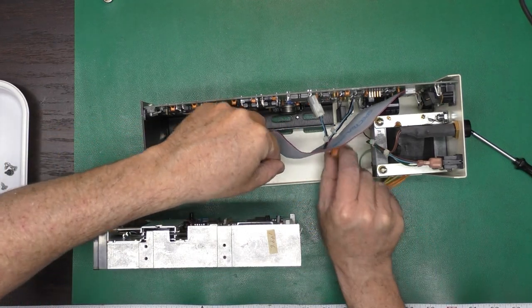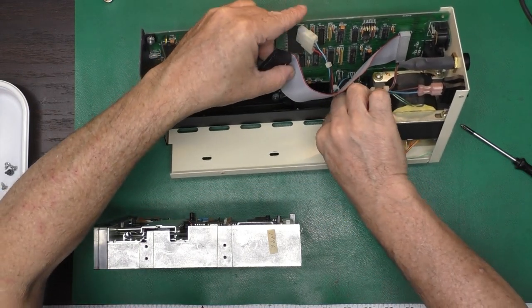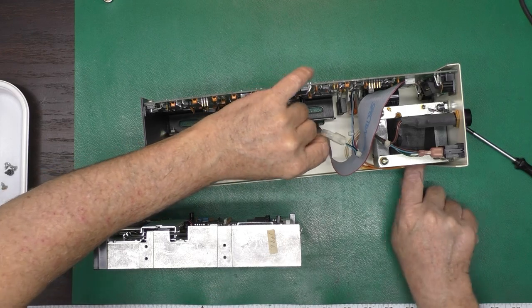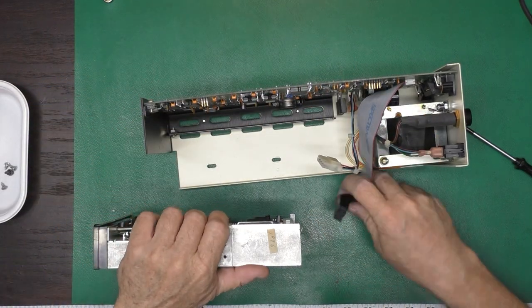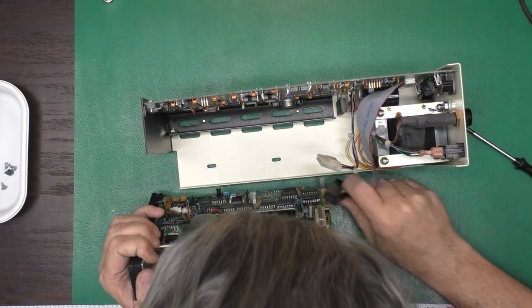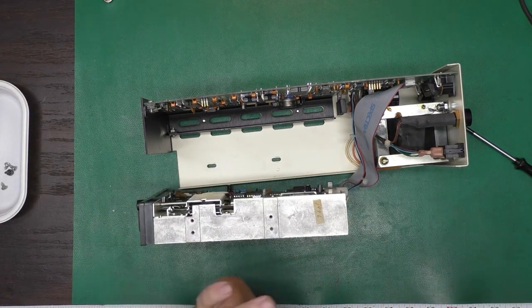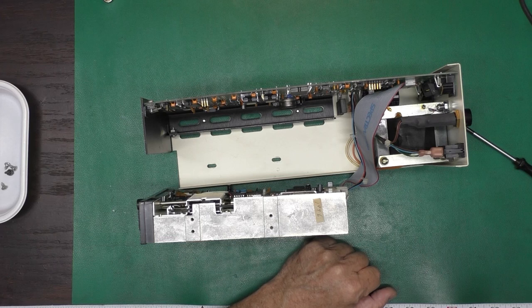Where was our power plug for the machine? Went down here. Okay. Yeah, see a little frame ground in here now. Come on, snap in there. There we go. And pin one goes up. I marked that. Power can only go one direction. This drive is a TEC-501. Tokyo Electric Company Limited, made in Japan.